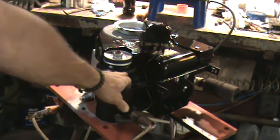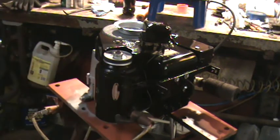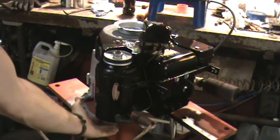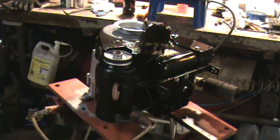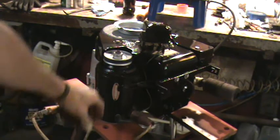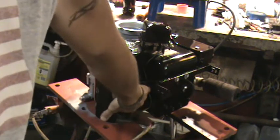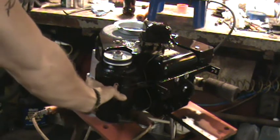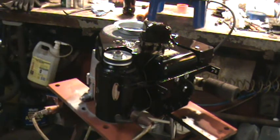So anyway, we'll try to make that the next video when I get to feeling a little better — me taking that starter generator apart, looking for the worn bushing on the tail cap. And like I said, I've already checked and my tail cap bushing is still too hot to touch, so that tells me that's where my wear is at. But if I've got a hot pole shoe on either side — on my starting side or on my charging side — that's telling you you've got one of two problems.